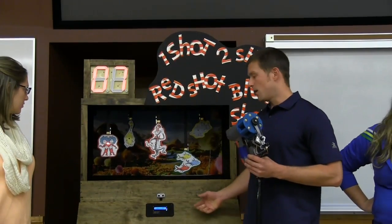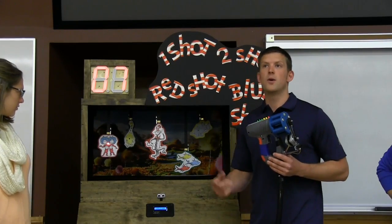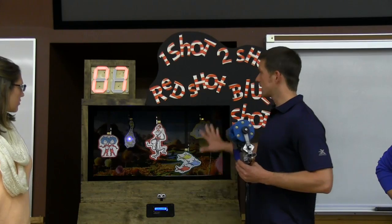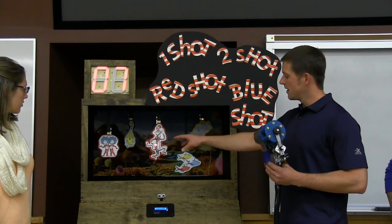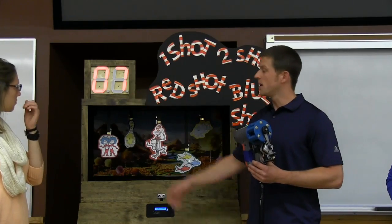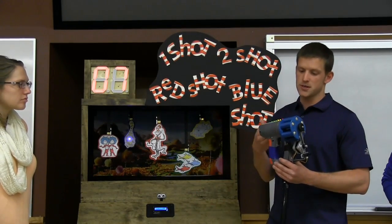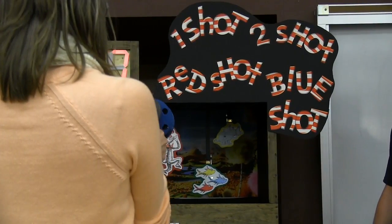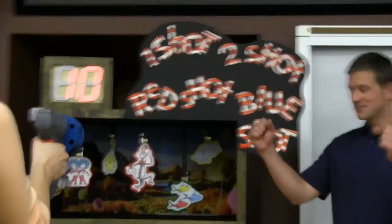For controls we have one Arduino Mega, one Arduino Uno, and two PICs. The Arduino Mega controls basically the whole console — the gaming system and all that. It also communicates with the PICs to control our seven-segment displays for the score. The Arduino Uno controls the gun and the sensors. There's also a delay that prevents you from shooting to spin.